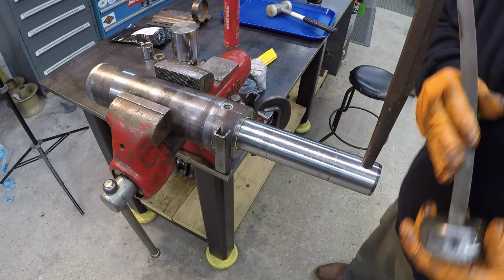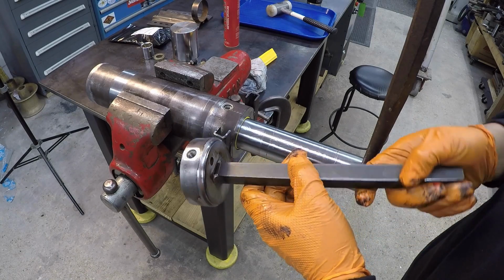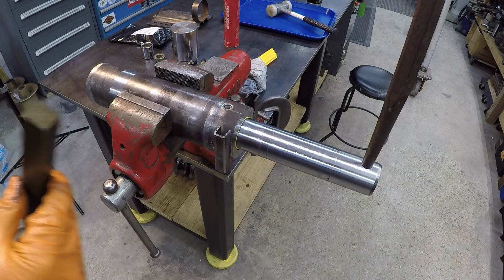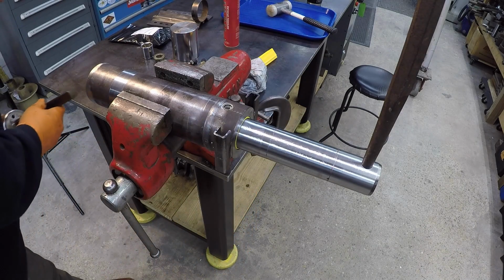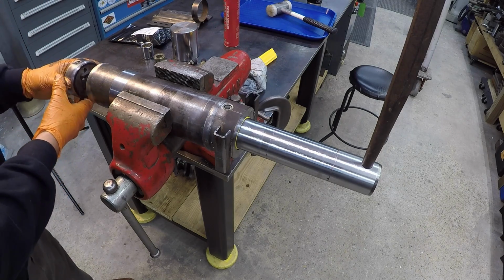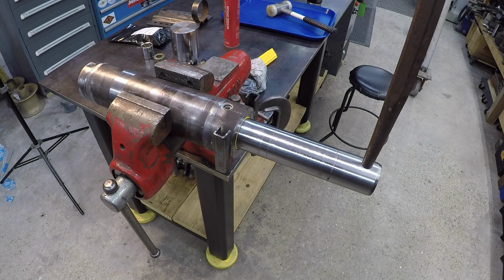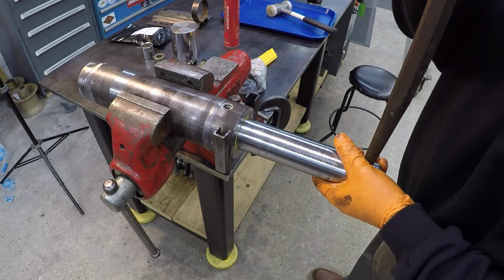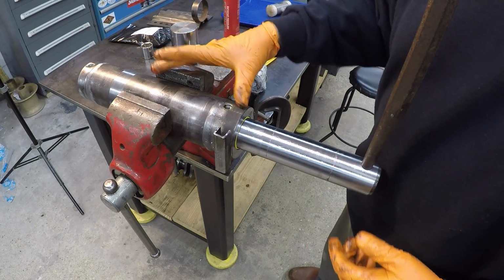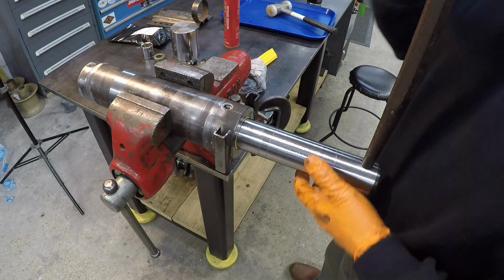And then so this is the back piece there. I've already got the bevel machined in it. We're just going to weld right into that V. All right, and then this square is going to line up with that piston. And then just go right up in there like so, and that'll butt right into the end. And then we'll just have to turn this like so to align both of the ports to make sure our hole and our ports are all in line with each other.